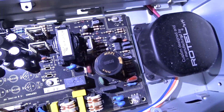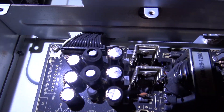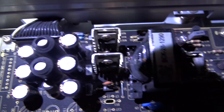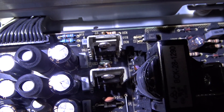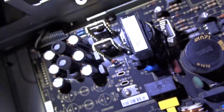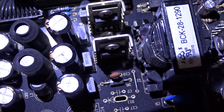And I have spotted it straight away. Always look for the heat sinks with capacitors next to them, because that will dry them out. Can you see what I'm trying to tell? Spot the difference — they should be concave. See those two heat sinks there? I'm not sure if they're regulators or bridge diodes. Let me see if I can get a better look at them.